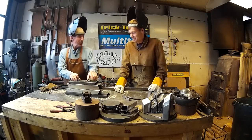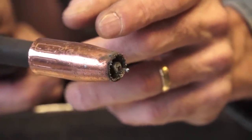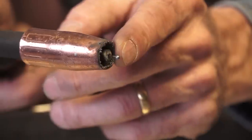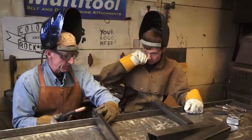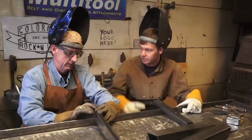When you're first getting started MIG welding, Alex, a lot of folks have a hard time knowing where to look and what to look for. And that's really pretty simple. Once you've pulled your hood down, you want to focus your attention right where the tip of the welding wire meets the metal. Once you squeeze the trigger, a pool will form between the pieces of metal. You want to give it about three seconds to form a good tack weld.